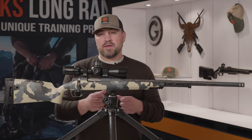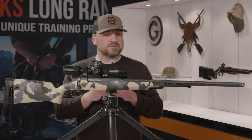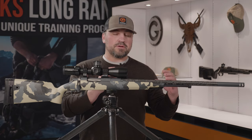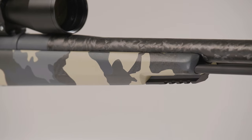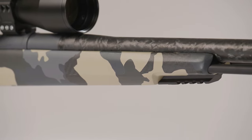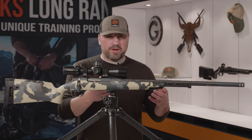Without the sabot, we can use a directional muzzle brake that's going to let us vent the gas out the sides, which is going to decrease the amount of debris and dirt that flies up off the ground when we're shooting, and it's also going to reduce the amount of muzzle jump. The 45 caliber, because of the smaller hole diameter, allowed us to engineer and use some carbon fiber to wrap this barrel — makes it lighter, makes it a little bit stiffer, and gives you that carbon fiber look that everybody is after.